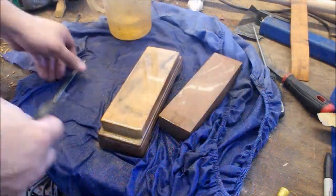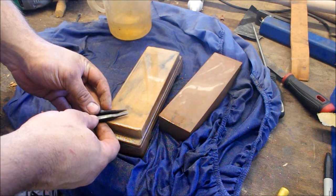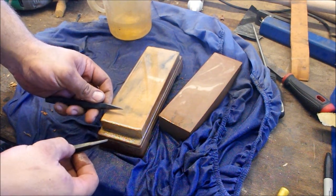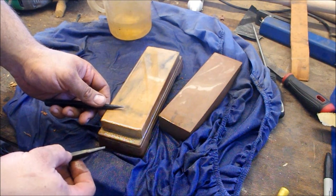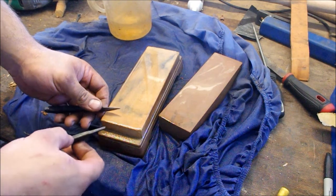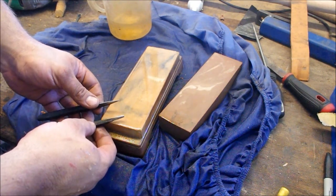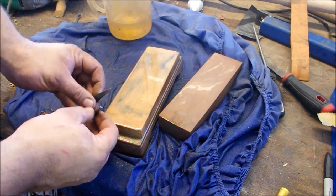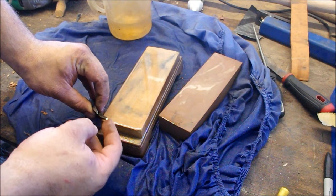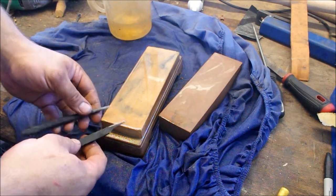Now, two things I need to cover. One is the reason I made two: I made one with a very fine point to test how fine it needs to be. Very acute angle. I think this is probably just under 90 degrees, so probably 80 or 70. And a slightly more obtusely angled graver. This is probably 90 degrees, much thicker, which I believe will stand up to the abuse.